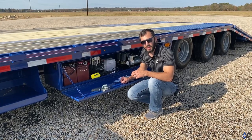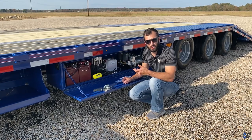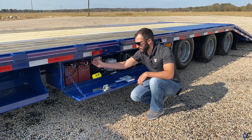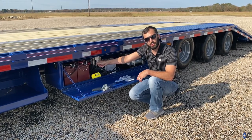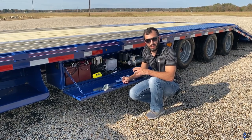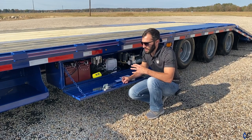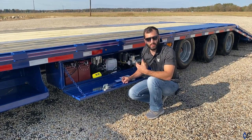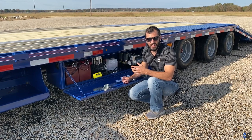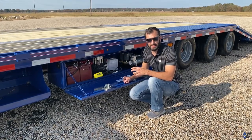Backing up just a minute — he chose hydraulic jacks and hydraulic dovetail that share the same pump. You may wonder how that works. There's a two-way valve conveniently located in this side box where it lets you select back and forth between dove and jacks. Now, what else is in this box is where it gets good: this trailer has a Ride Well air ride system on it. This makes your load ride smoother, it's less wear and tear on your truck, less wear and tear on your back. And there are actually some loads that hotshotter can't haul unless they have an air ride system.